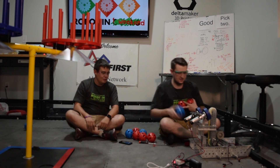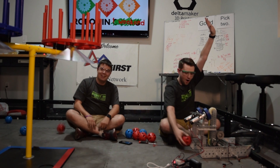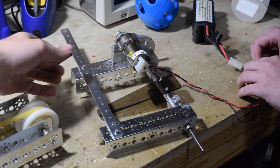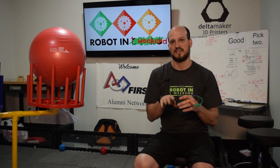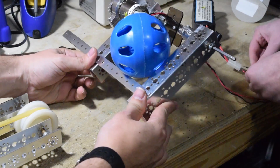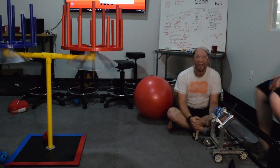We didn't have any capability to get a wheel spinning easily that way, so we had two different ideas. We had a wheel shooter option, but we also decided to do a flicker shooter. We took some six-inch-long pieces of Lexan with a little bit of taper in the finger. It spins around at a relatively low RPM, and there's a bar that causes the Lexan to fold back and flick forward and hit the ball. That shooter was incredibly consistent because spinning at a low RPM, the flex of the Lexan is pretty consistent. We were able to make shots really quickly in our first try, and we were really surprised by that.